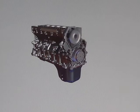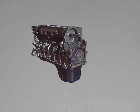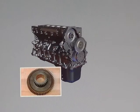The rear camshaft gear is held onto the camshaft with a rear clamping plate. The rear camshaft idler gear is a compound gear designed to interface with the rear camshaft gear and the crankshaft gear.